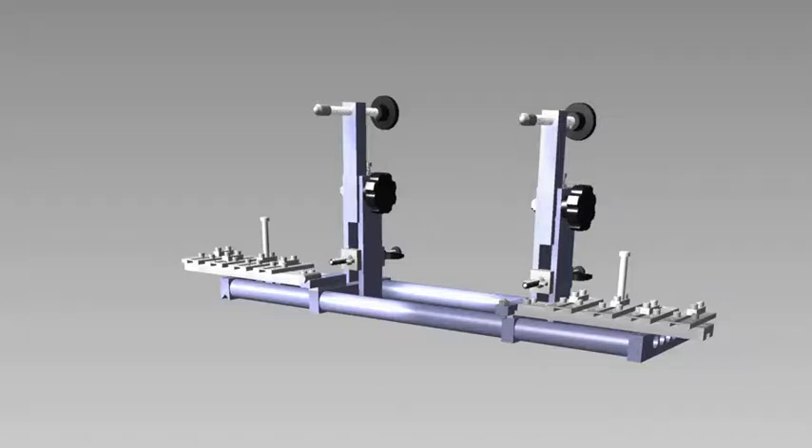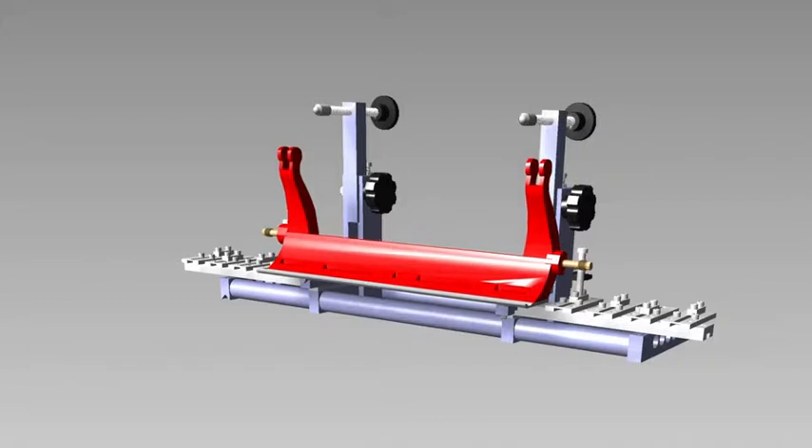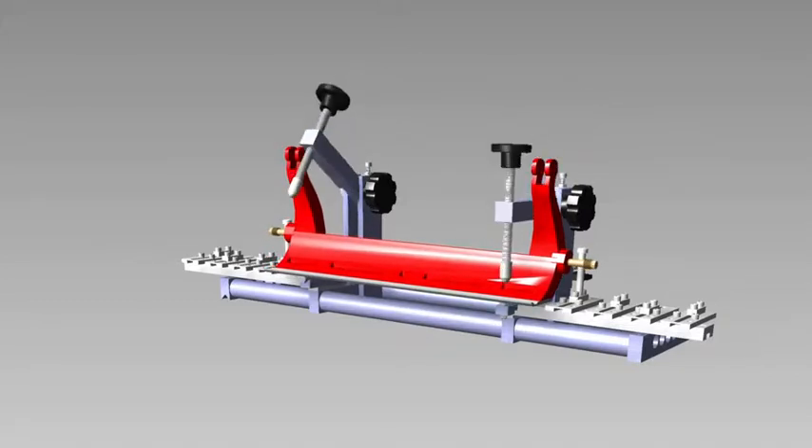The bed knife is aligned horizontally with a series of nuts which can be set for each type of bed knife. Once the nuts have been calibrated to within one thousandth of an inch, they are not moved. Precision pins are mounted in the appropriate nuts, the pivot pins are replaced in the bed knife, and mounting becomes quick and easy, ensuring that the front face of the bed knife will be parallel to the mounting pins to within one to two thousandths of an inch.